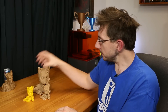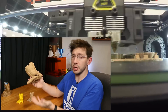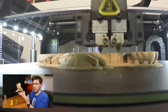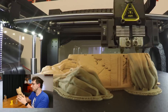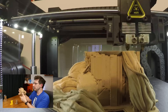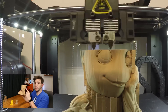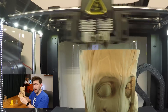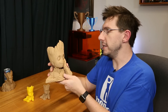This is a good Groot — it looks wonderful. Why does this matter though? Because of this. This Groot was sliced using Simplify3D and the G-code was copied to a USB stick, which I then put in the Raise 3D N2 Plus and printed out using the Hatchbox Woodfill PLA. But it looks terrible. There's this hole right here and this blobby part, and it all has to do with Simplify3D — this model not being, as Angus puts it, properly baked — and the combination of having multiple little models within the STL file.